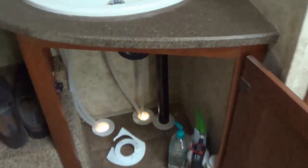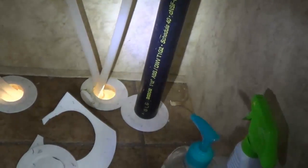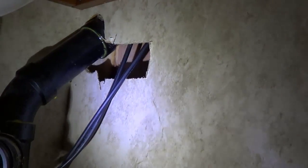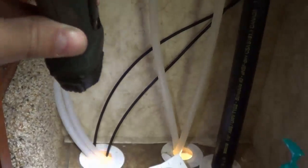In the bedroom, under the bathroom sink, is where one of the venting pipes comes down from the roof through the wall. I took off the plastic seals around there to access the hole, and cut away a little bit so I can get a hold of the wires when I string them down. They should come straight down from that vent and straight down in the wall. I had to cut a little bit of a hole in there to find the wires, but it's all buried under the sink — no one sees that area — so I can just put a little patch on that, just another piece of wood screwed in. Then I'll wrap it around the back of the plumbing and it'll head off into the basement.